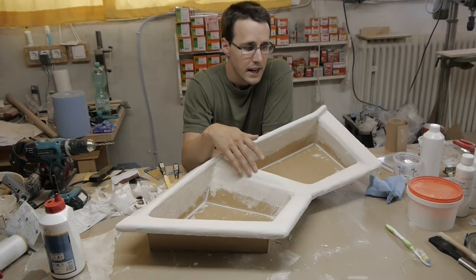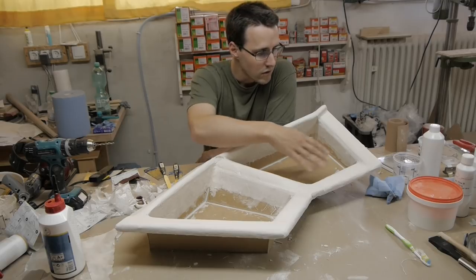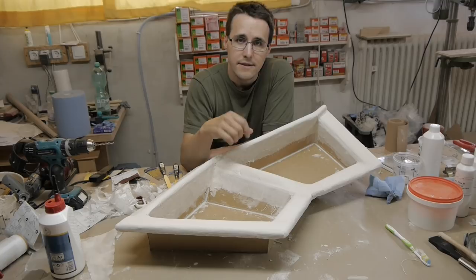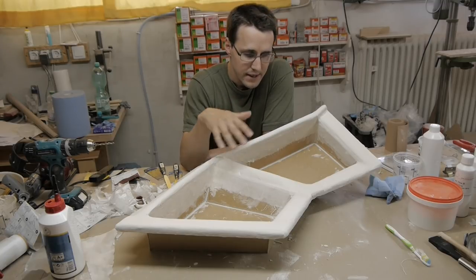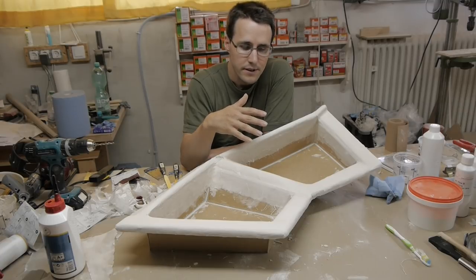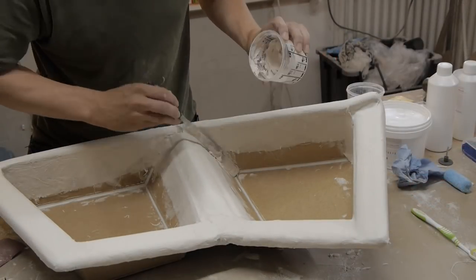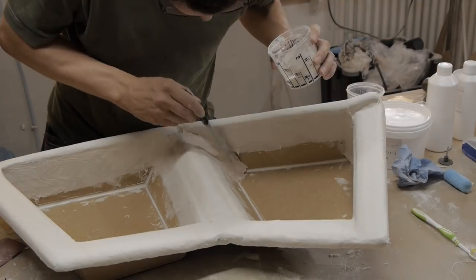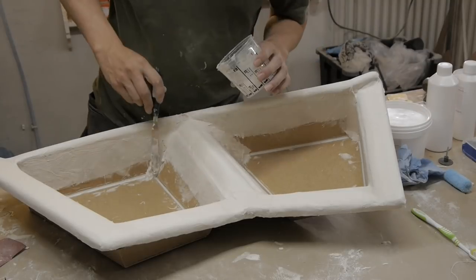And at the end, I will use the same mixture to go over the frame again and again and close last cracks and small structures, and sand it all the time after it dries until the whole frame is flat again. The roundings can be easily done with the help of a silicone foam.